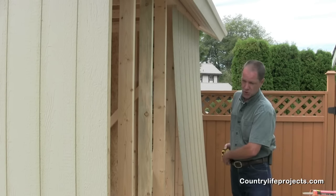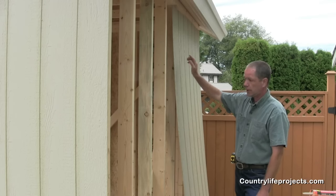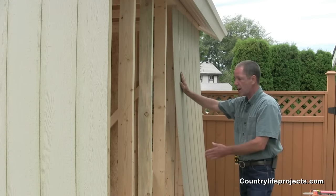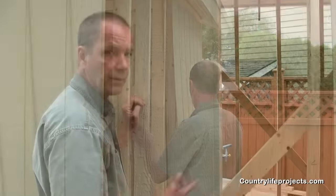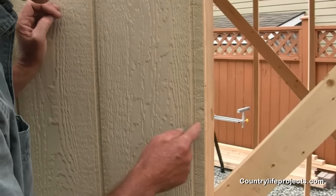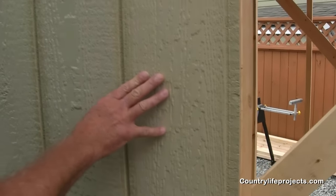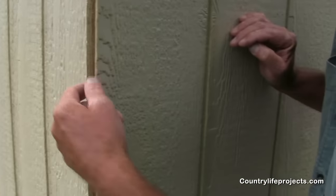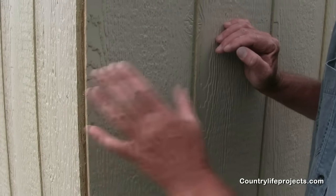There's not really too much to it on this side. I want to make a note that the piece we cut off at the end is going to be used on the other side, and we're going to be starting the other side differently. These panels are 48 and 5/8 of an inch wide. So when you go to center them, it's going to seem kind of strange because the panel will actually come to this edge here. To make sure your SmartSide panels are centered properly, this line here is the part that's exposed — that needs to be centered on your stud. How that works out is that this edge here is almost on the outside of the stud. And at the other side of the front corner, you'll see that this edge here, which is our lap edge, is flush with our other panel on the inside — right at the edge of our 2x4 wall. That's how your panel should be positioned.